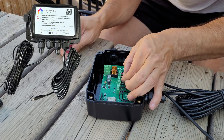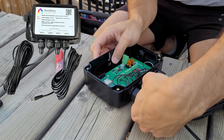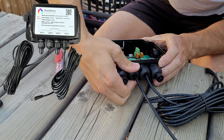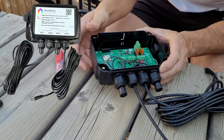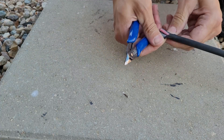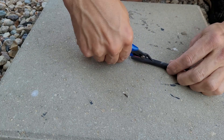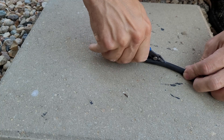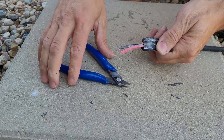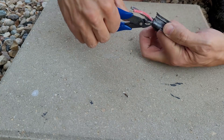Pull out the second one and put the power injection cable in the same spots. Our cables are red and black — red is positive, black is negative ground, and there's no data wire, so that'll just be left empty from where you pulled out the LED cable. Tighten those cable glands up real tight — you can torque them right down, you're not going to hurt them. From your 200-watt power supply that you're going to run to your controller, you get 20 feet of cable off the power supply, so figure out how much you actually need. Once you know, you can cut it and open up the casing — these little snips work pretty good, just expose your wire and snip off that bit of casing.